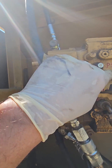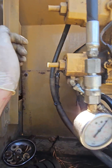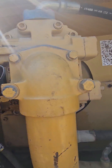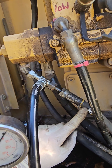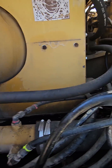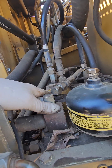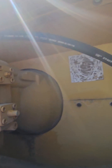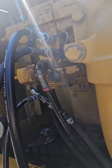So we have this third pilot signal. This has nothing to do with this line and this line. This pilot signal is the actual, for-real pilot line. I'm calling these pilot signals because I don't have a better name for them, but they're really the bleed signal — balancing swash plate signal or something like that. But this pilot system, which has already been thoroughly tested, sends pilot signals to control all the different valve assemblies, buckets, tracks, and all that. All that is fine.